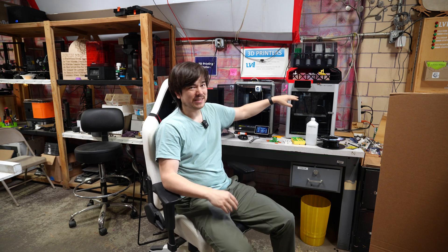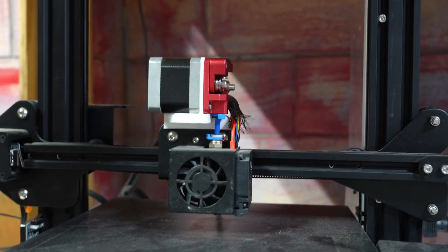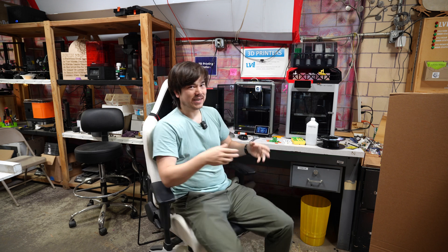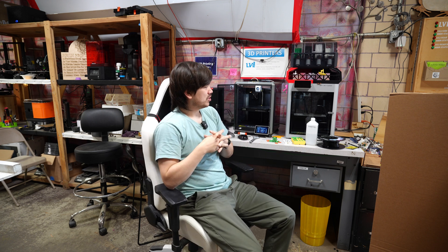Same with the Bambu Lab X1C — they have the heat sink, heat break, and nozzle all in one assembly. So you just unscrew it, take it out, throw it away, and replace it, and you completely get rid of the problem. On older designs that had the nozzle separate from the heat break and heat sink, you could run into an issue where you replace the nozzle, but due to a failed 12-hour print the extruder was pushing filament at temperature for a long time. The heat will eventually work its way up into the heat sink area, melt the filament a little, and it solidifies into a somewhat permanent clog — which can only be removed by special procedures like heating up the actual heat break and force-feeding it through. But that's never ideal.